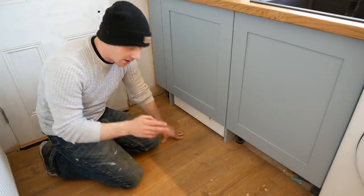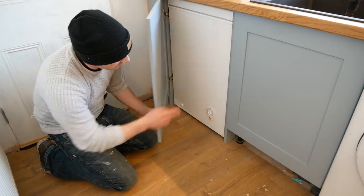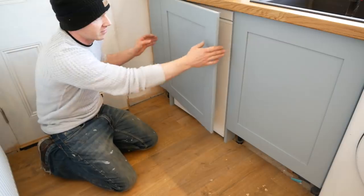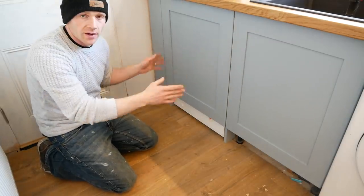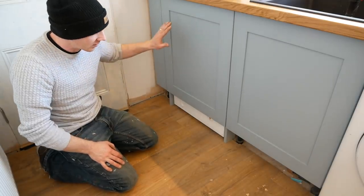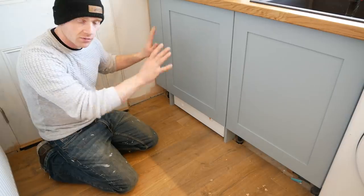What I was trying to explain earlier is I put these 18mm verticals in to act as the door sides of the 600 space that's here. I've also allowed for the fact that if we wanted to do away with the freezer or get some integrated unit in the future, it's 600, it's fixed. I could slide a unit in there and be done with it.